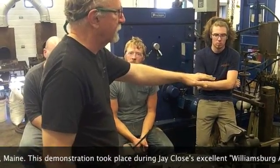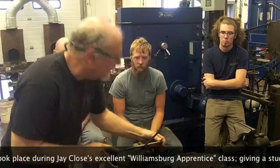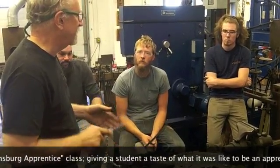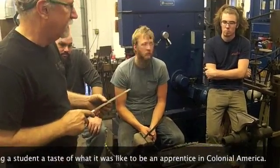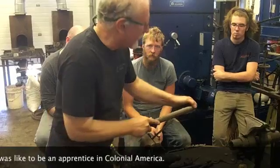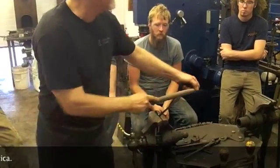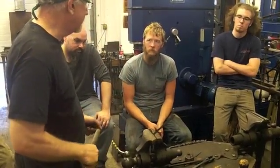Forward stroke. So if you're doing that, you're expending twice the energy necessary, and you're wearing a dull blade with old teeth. It's like a plane. So you need to bear down to make a cut on the forward stroke and then relax on the back stroke. You don't have to pick it up and set it down, but you don't want to rub the surface.